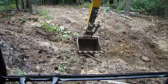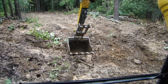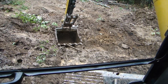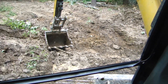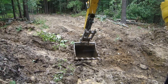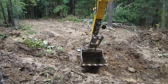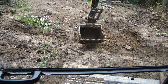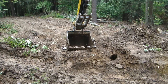I have the trench dug where the driveway culvert is going to go. I'm grading it out so there's an even slope across the 30 feet of culvert that I have. Then I'm compressing the dirt — a lot easier with two hands — and compacting that dirt down. It's all compacted where the driveway is going to be.